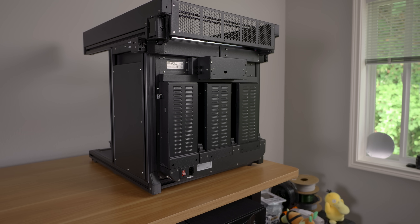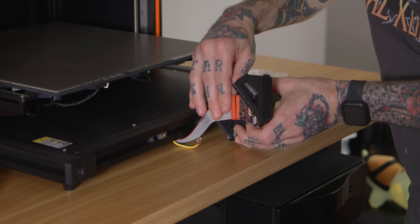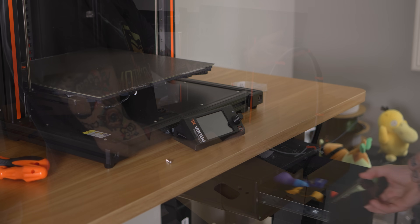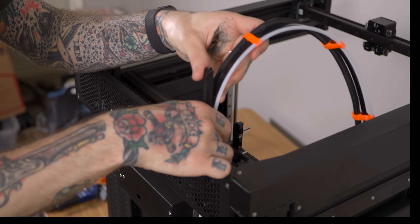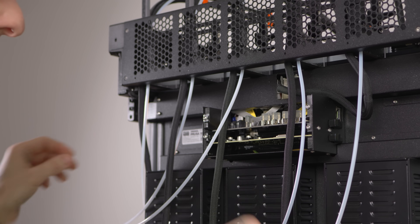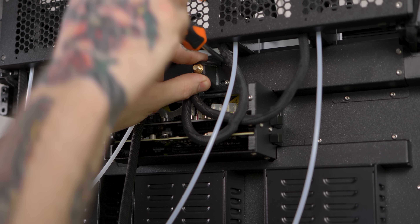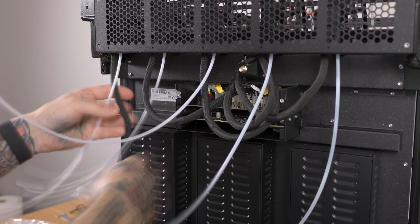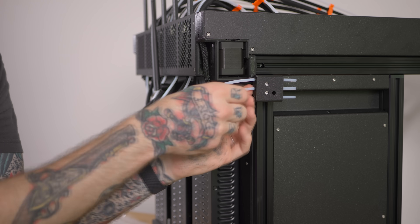The back of the machine has triple power supplies, and I found the right angle power adapters for the inlets to each of those really interesting. Assembly begins with installation of the screen onto the front of the machine, followed by installation of a dock, harness, and reverse Bowden tube assembly onto the extrusion at the back. There is a nut bar in place so you don't need to locate anything in particular. That's followed by making a couple of electrical connections, and in my case, the Wi-Fi antenna needs to be installed on the back. The rest of the harness connections are made onto some little daughter boards at the back, with a couple of sheet metal panels covering them. Reverse Bowden tubes clip into the side filament sensors.